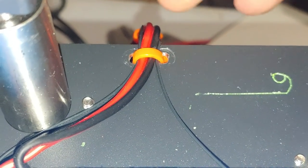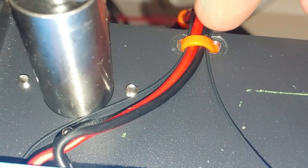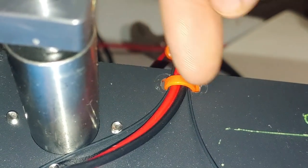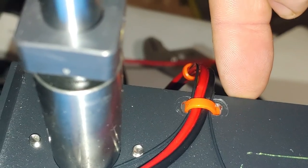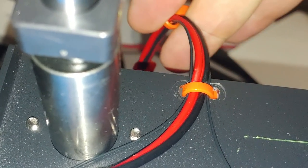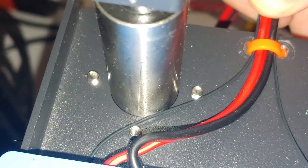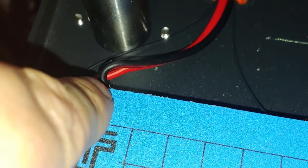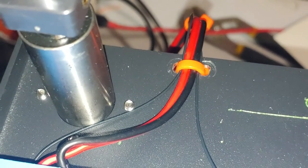One other change: I'd like to see two 8mm holes drilled into the frame here, wide enough to allow the bed wires to sit between the holes. Run a zip tie through — use a thick zip tie, not a skinny one, otherwise it'll dig into the wires or cut itself on the metal. This gives you built-in tension relief for your bed wires with just a little slack, so your solder joints don't fail over time. On a CoreXY the bed doesn't sling back and forth, but it still flexes those joints. It's a free fix — just drill two holes.